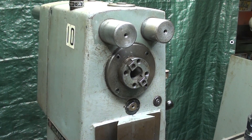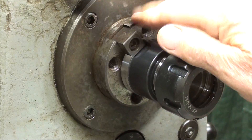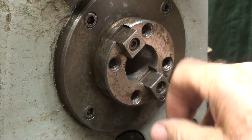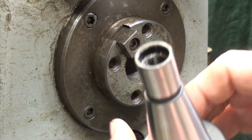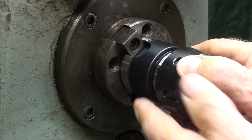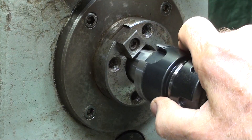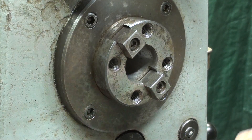A number 50 milling machine taper is a very popular one on larger machines. This number 30 was also used on the vertical South Bend milling machine, of which they did not make very many as far as I know, but I did have one at the high school. Since this is not a self-holding taper, there are lugs provided on the spindle here, and the lugs fit into these slots in the holders — and that's what does the actual driving. Otherwise, there's probably a tendency for the taper to slip in the spindle. So that's the way they're designed and built.